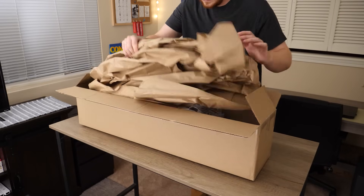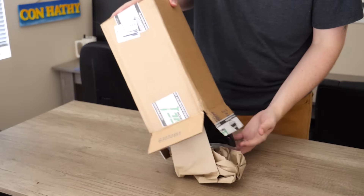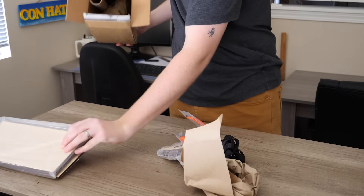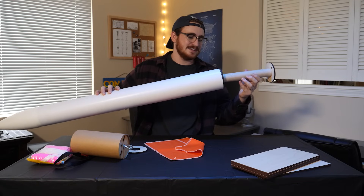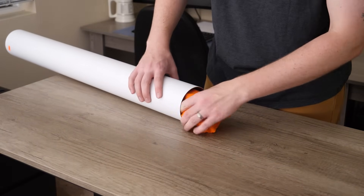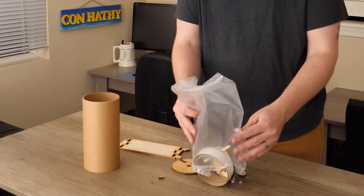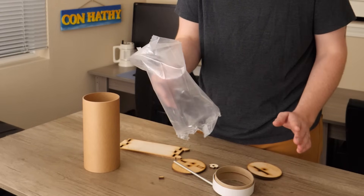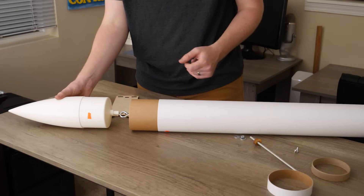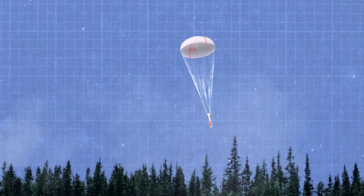So here's the plan. I decided to design and scratch build this rocket myself. There are great kits out there and they're probably better and cheaper, but I really wanted this to be my rocket with room to grow and experiment once I get past this first flight. I went with a short 4-inch rocket to give myself plenty of room for payload and increase my drag and weight. Usually we think of rockets as light and low drag, but a common strategy for certification is to fly low and slow to limit the stress on your rocket and make recovery easier. The higher you fly, the farther the wind is going to blow you when you come down under a parachute.